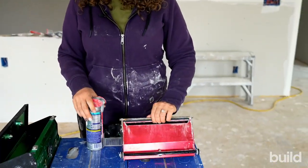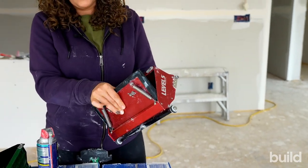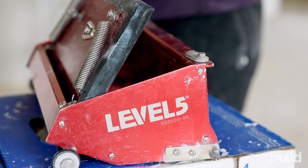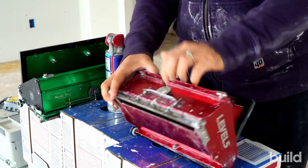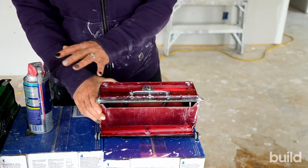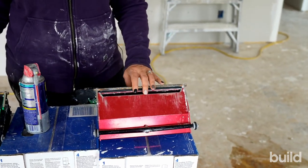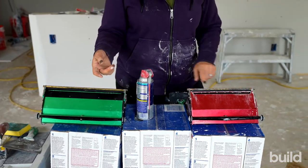This is the Level 5, 10. This one has a floating back — this back moves. You need to be running springs on floating backs. If you don't have springs on, the back's going to fall out. So depending on the box will depend a lot on your springs. Same settings, zero all the way to five. This one doesn't have quite as much of a crown; it's starting to get pretty worn down, so it needs some maintenance. But they both run the same way — mud goes in here, you push on the box, it comes out the top, and then the blade trails behind.